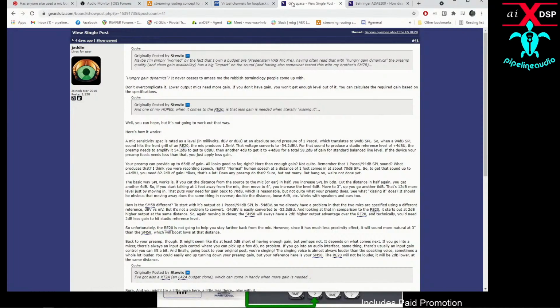Remember that 1 Pascal is 94 decibels, that's sound pressure level. What produces that? I think if you're recording speech, right? Normal human speech at a distance of 1 foot comes in at around 70 dB SPL. So to get that sound up to plus 4 dBu, you need 82.2 decibels of gain. Yikes, that's a lot. Does any preamp do that? Sure, but not many. But hang on, we're not done yet.